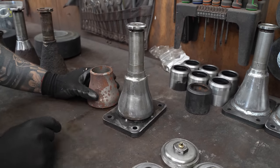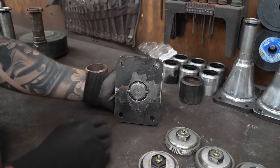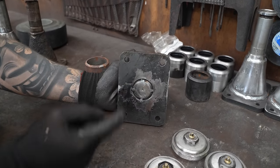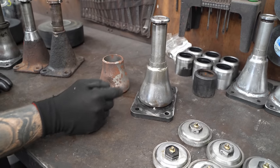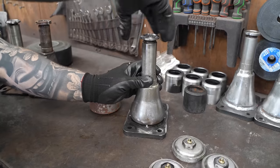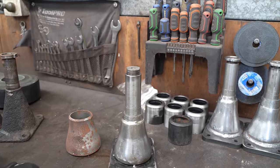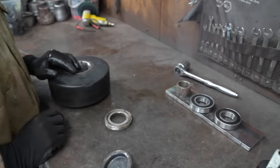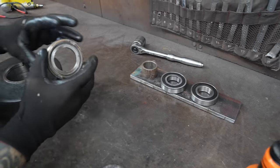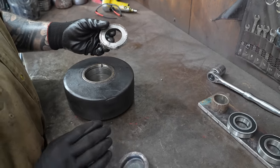We've turned a shaft and AutoCAD drew a plate that's got a hole in it so it centres — the shaft runs all the way through and centres on that. Then we've turned it all the way down for the bearings, and Glen was nice enough to turn a thread on for us. So that's how they work: we've got our two bearings, then a spacer in between, then the inner seal, then the outer cap.